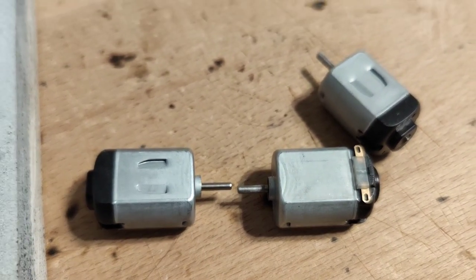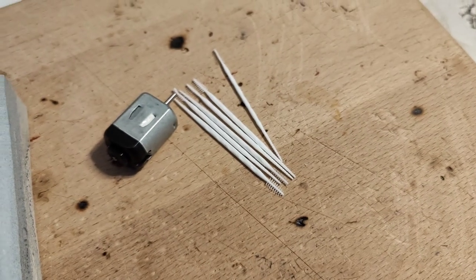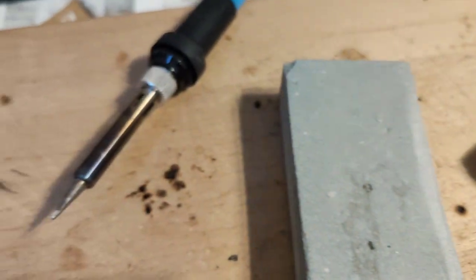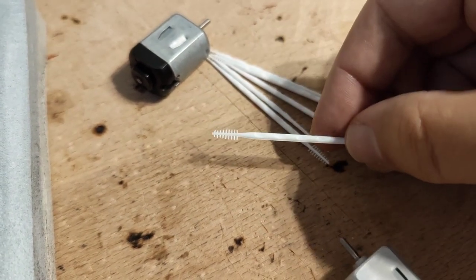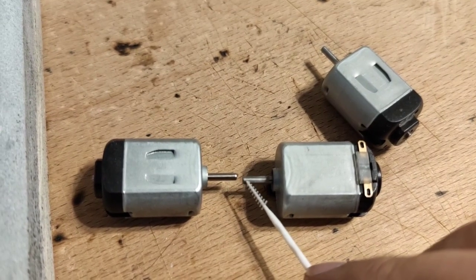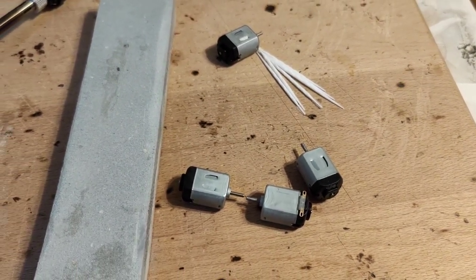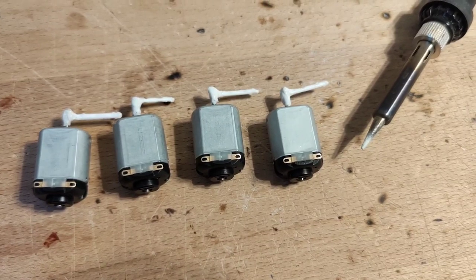When the roughening is proper, I trust that these motors should be able to hold plastic holders. I discovered that standard plastic toothpicks can be very well melted with a soldering iron, so I will melt toothpicks around this roughened-up surface and thereby hopefully have something which will hold well enough to the shaft. Pumice is the word of the day.